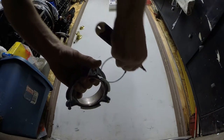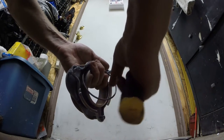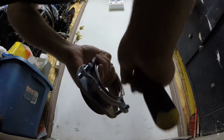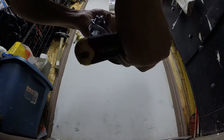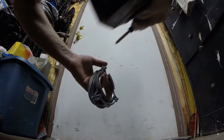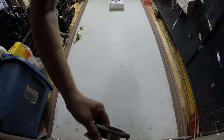When you're putting it back on, you've got your plumber's putty under the flange, then under the sink the cardboard goes, then the plate, then the assembly, and then your ring. When you're putting the ring in, you reach your one hand down through the sink, grab the ring with one hand. Of course you won't be able to get your thumb, but you go this way here, all the way around. Yeah, they're always a little bit tricky no matter how you do them. You can use your screwdriver to assist. Either way, there it is. Locked in, tightened up. You can use your drill. Remove the excess putty from the sink tray, and you're good to go.